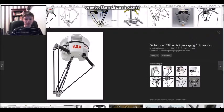What lead through allows you to do is grab the arm, move it to a position you want, and record that position. Once you've moved it to all the positions you want, you can say play those positions back, and it'll play them all back. As they say in the reveal video, in essence you're not programming the robot, you're teaching it. Anyways, that's what I've been trying to do with this style of robot.